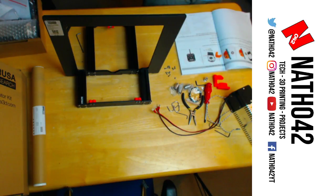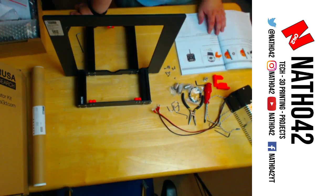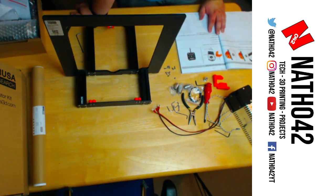Don't tighten the screws fully. You will need a loose Y belt idler to adjust the tension in the belt later on. I may have done that, but that's fine. I can also untighten them. I'm not an idiot or whatever.